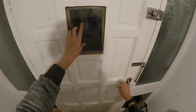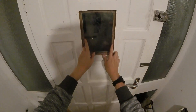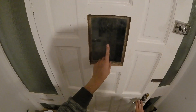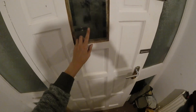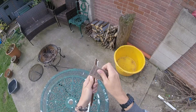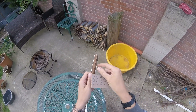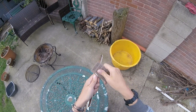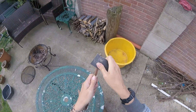The next step is going to involve some putty and also getting the bits of beading tidied up and put back on around there. The glass needs a bit of a clean as well. It's got very dark outside. I've got these bits of wood which hold the pane of glass in place, and I'm getting them ready to put back on by using a really fine sandpaper to make sure there are no edges or any glue still left on them.